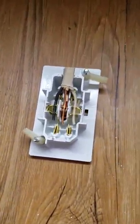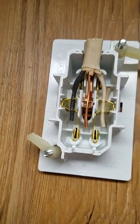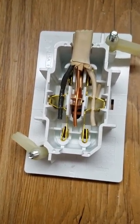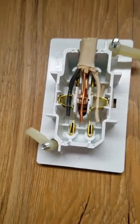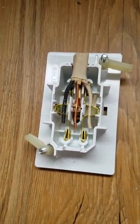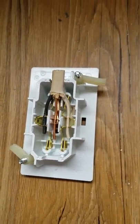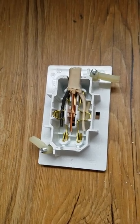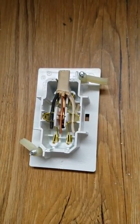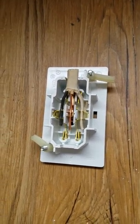My main thing was to show you how to take these wires and get them into these self-contained outlets and switch boxes. It's not easy without the tool, and some people try to force those wires in with a screwdriver. This was the easiest way I could find: make yourself a little press assembly with a couple of C-clamps and a piece of wood. Hope that helps somebody, because I sure could have used the help when I was looking. Good luck.